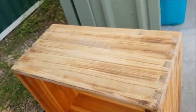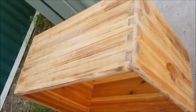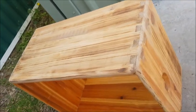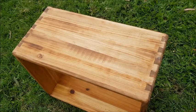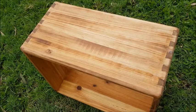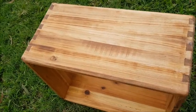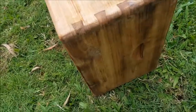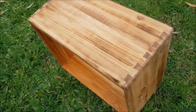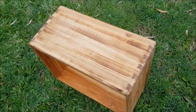So my question is do I need to go over it with the torch again? I think not. I think what I'm probably going to do is just stain it to bring out the grain. I mixed up a very thin mixture of water-based jarrah timber stain, went over it, let it sit for a few minutes, and then wiped it over. Could be a little bit darker but I'm pretty happy with that result.